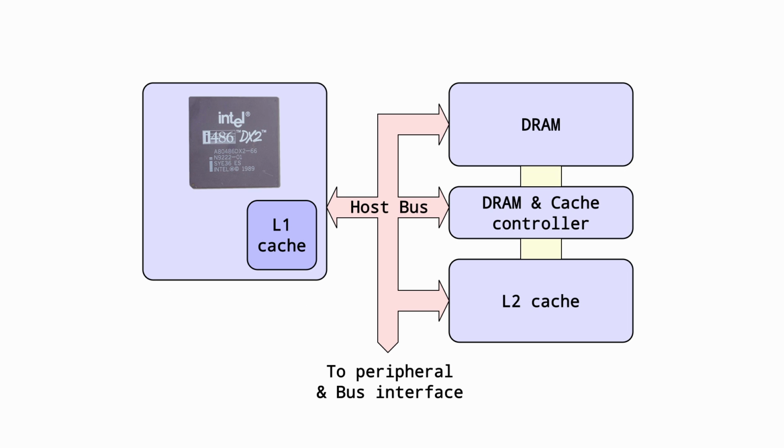The 486, or at least the ones from the time Doom was released, have 8K of L1 cache in write-through mode. Write-back came later. And they were typically also equipped with some level 2 cache on the motherboard itself. Something like 128K would have been common, as far as I understand. If you're interested in all the gory details about old CPUs, I recommend checking out the CPU Galaxy YouTube channel. Lots of info there. I'll leave a link in the description.